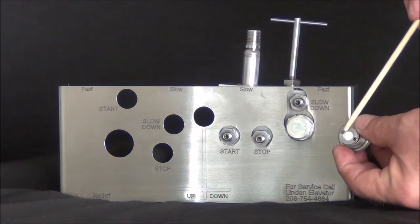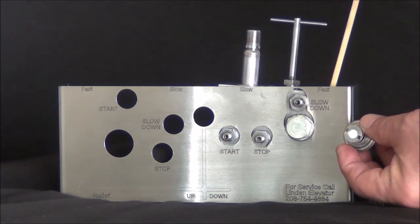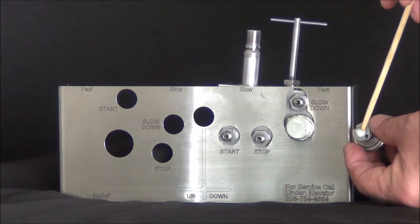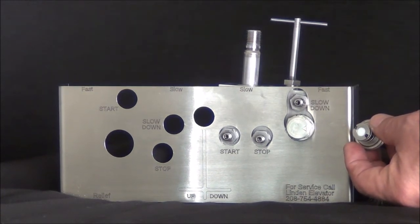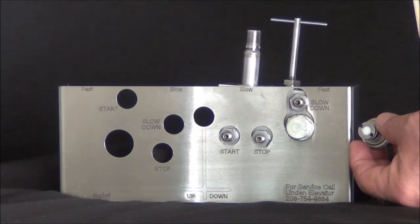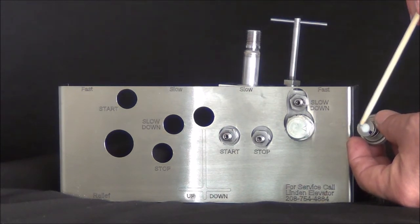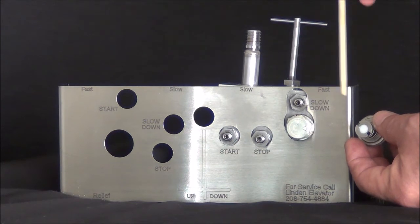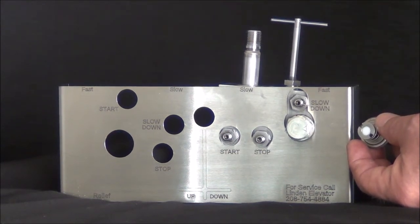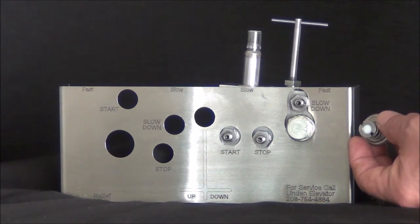We also have this white seat right here, and it matches up with a metal seat inside the control block. If there's any debris in here, that's a problem, or inside the pocket. We want you to clean this pocket as best you can with a lint-free cloth and wipe this surface down. A small round wear ring in the center of the seat is not a problem and is not the cause of the issue.